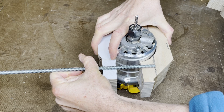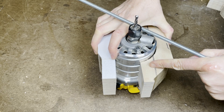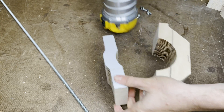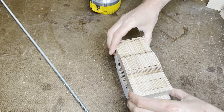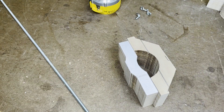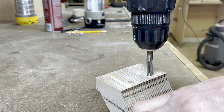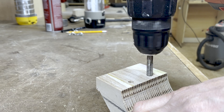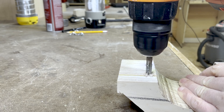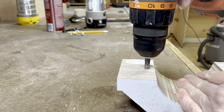This is the carriage and this threaded rod is going to be epoxied into the large back piece of the carriage. It'll stick out through the smaller front piece on the left. I'll take these two pieces, stack them up and clamp them together so I can drill straight through into the places where the wing nuts are going to go. The clamping force on the carriage is going to be significant because the wing nuts need to hold that router really tightly in place, so I'm tapping the holes here with a 5/16ths tap so the threaded rod has a little more to grip onto with the epoxy.